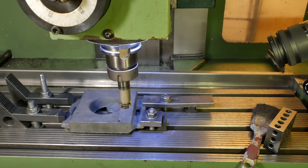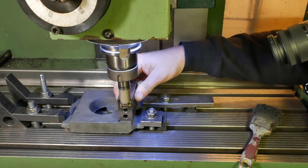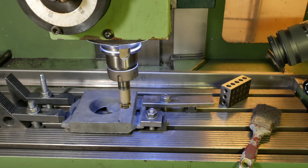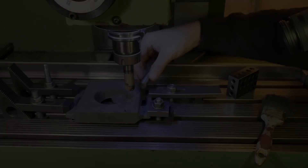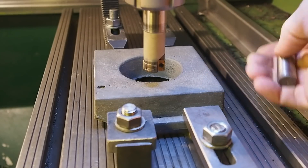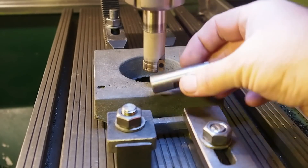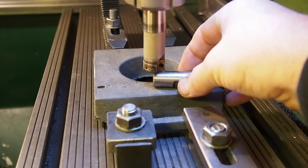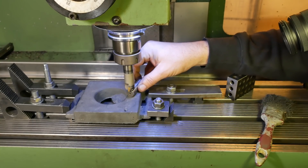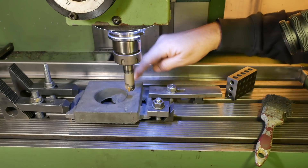There's my conditional stop. It should be 50mm above the part. Okay, it's not. So something's wrong with the offset. Shut it down, check all the offsets. I now realize why that offset was off. This material is 26mm thick. I use a 16mm old broken endmill shank as my touch-off tool — this is my reference zero. So I set that to 16mm above it, but then I typed 26mm in. That's why I was 10mm off there.